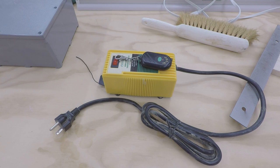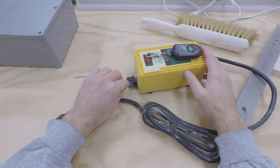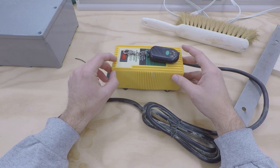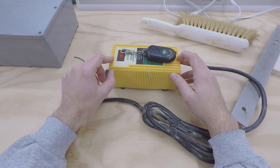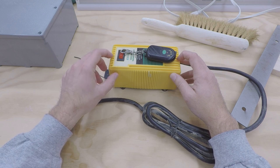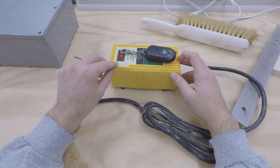I went online, did some research, and saw a guy with a pretty elegant solution — I'm going to show you my version of it. My distance from the panel to the dust collector is about 40 feet of 12 gauge wire on a 20 amp circuit breaker, and it's been handling fine. I think the old circuit breaker had a little more tolerance than the new one. Rather than trying another pre-made unit, I figured I could build one for the same price or less, and it'll be more reliable with interchangeable parts.